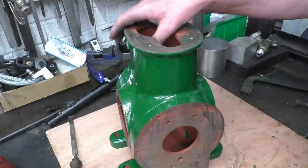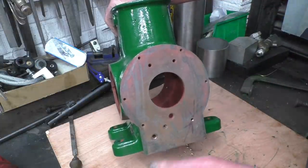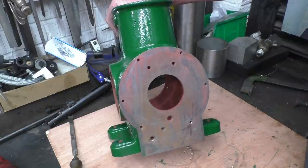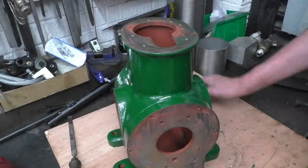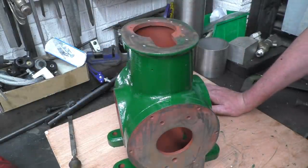What I intend doing is get the oil pump assembled and bolt it on here before I put the crank in, just to make sure that the oil pump is in fact working all right. Then it's straightforward — clean up, make new joints and reassemble. The worst part is the steam cylinder lubricator; the pump for that is in a real mess. My friend Bob's got that away — if anybody can resurrect it, I'm sure Bob can.